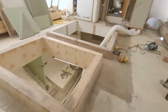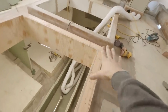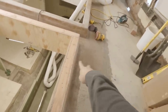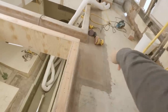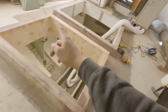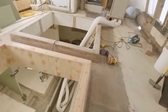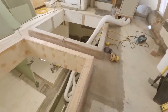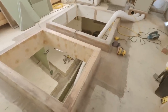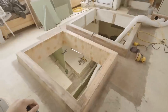What we've done so far today, you can see this fresh wood over here. This corner was actually high because we had put full thickness of glass on the deck right there, just in that quadrant, and over there as well as the rest of it, it was just a single layer of matting. So I had to plane that down to bring it to a matching level with the rest of it. Now that's done, we just have to come back in and round off the corners.